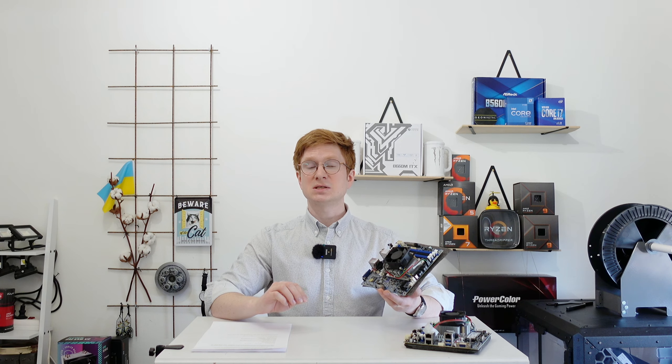The main difference between these two variations is the absence or presence of the PCIe X16 connector. The official Gigabyte motherboard has a full-sized PCIe X16 connector, while the unofficial version has a slimline PCIe X8 connector which can be used with a riser or cables to convert it to M.2 or PCIe X16.